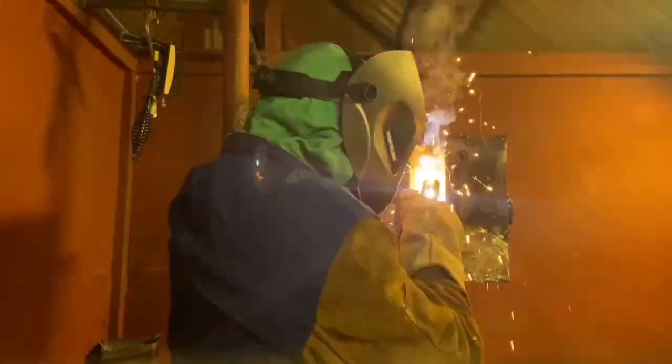We're over here just making sure that you have the 6010 electrode shoved into that little keyhole — you can barely even see it. I'm whipping out, coming right down, side to side, opening up, coming down, side to side. Also don't forget to subscribe and smash a like.